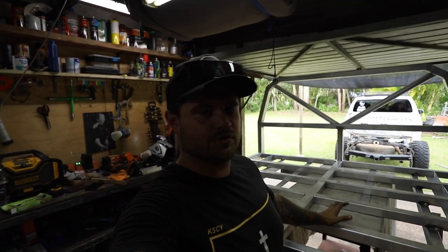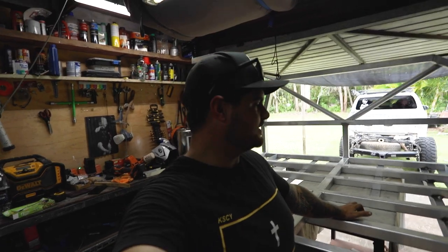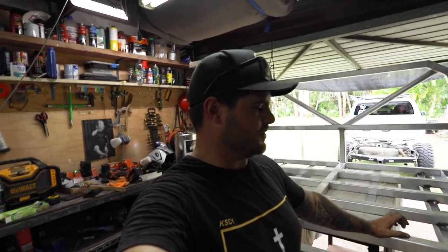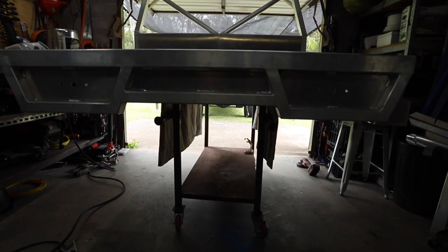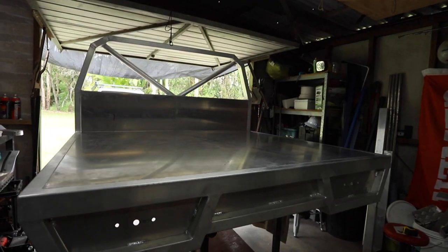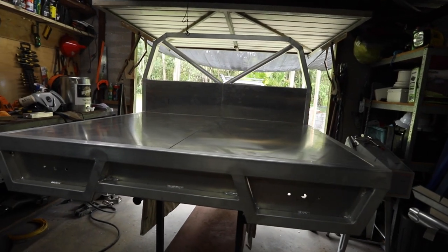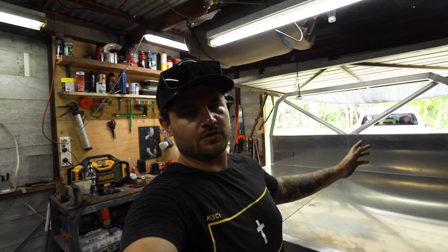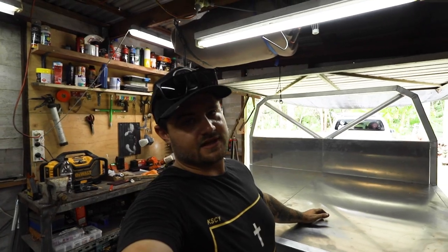I just finished all the mounts - they're pretty solid, the penetration's definitely there. We'll get on to putting the sheet on. I'm going to Sikaflex it but we'll dry fit it first. The tray sheets are fitting pretty good. What I'm going to do now is take them off, start Sikaflexing where I'm not going to weld, and probably stitch weld it all underneath with the spool gun.